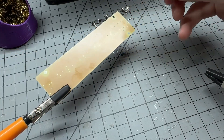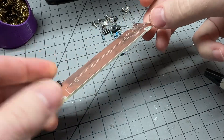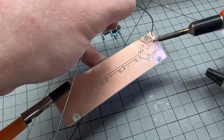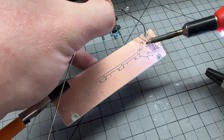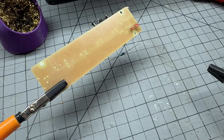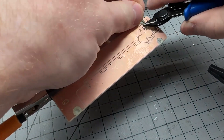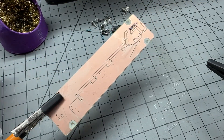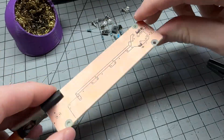When soldering our components, we solder on the mask side or copper side of the PCB, which is the bottom of the board. Start by inserting the two ceramic capacitors as shown on the example PCB — the large capacitor on the outside edge and the smaller one on the inside. These capacitors are non-polar, meaning orientation does not matter. To solder a PCB, first heat the bottom of the hole and the leg of the component before adding solder, allowing solder to flow evenly between the component and PCB board rather than just up the leg. After soldering both capacitors, use wire cutters to trim the excess legs. Next, solder the larger capacitor in the correct location on the opposite side of the board — this component is polar, so the stripe should be placed inwards. Leave some room to fold it flat after soldering.